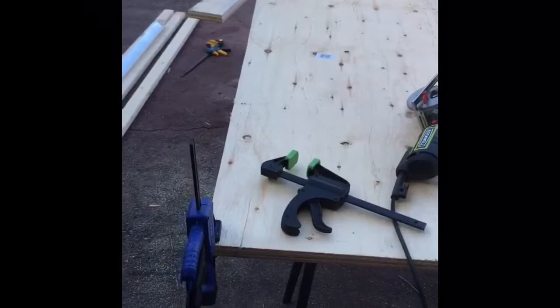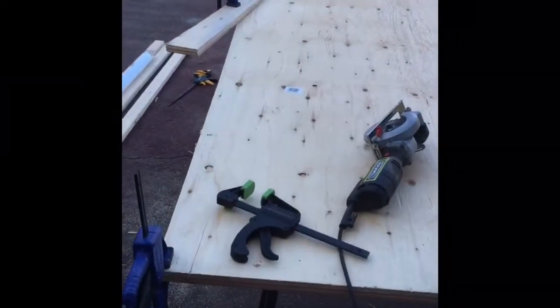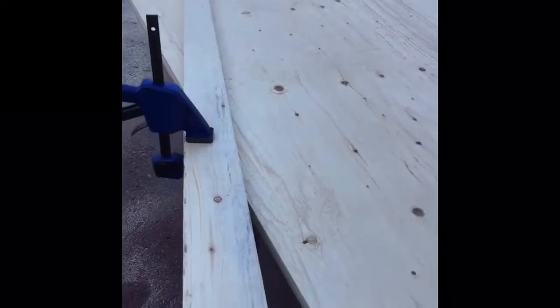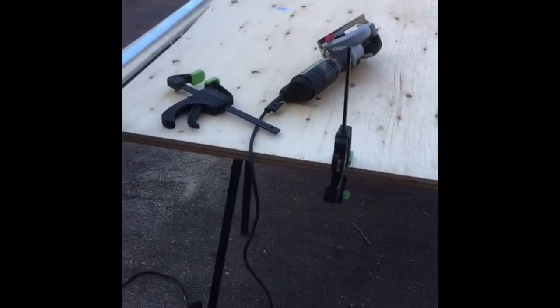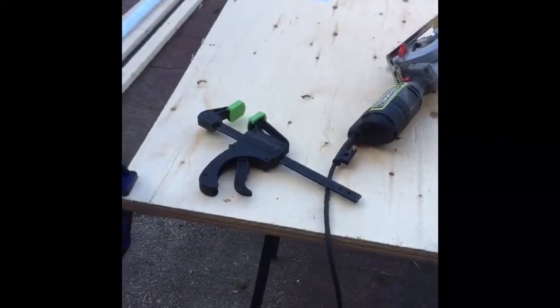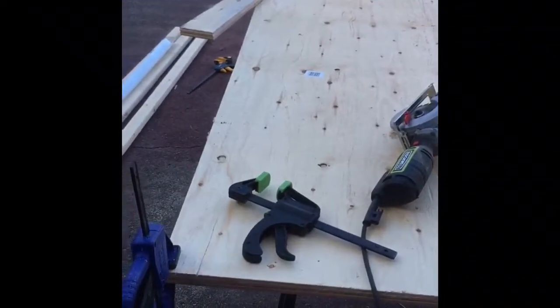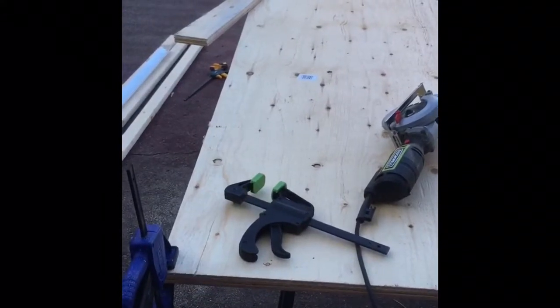All we're doing is a slight slope down — we cut four inches off one end of the four-foot base sheet of plywood, right down to four feet at the other end. We left it a half inch short because the roof will overlap the sides for water and structure. A correction: I said quarter-inch plywood but it's actually half-inch. The slope is primarily for slight aerodynamics and mainly for water to roll off.